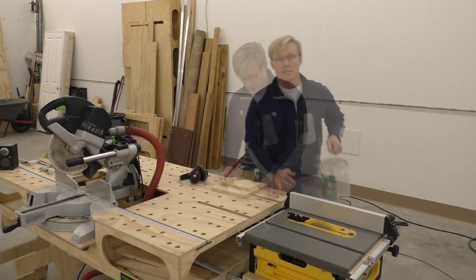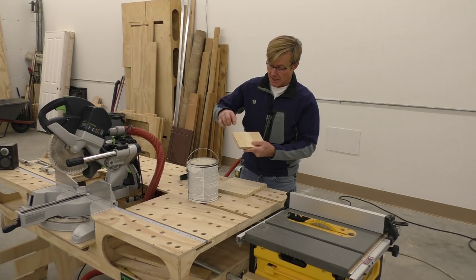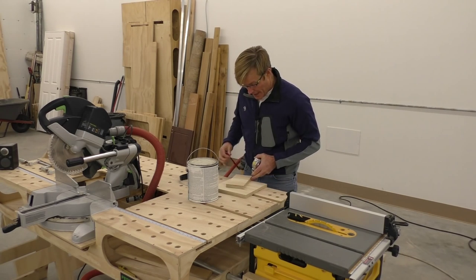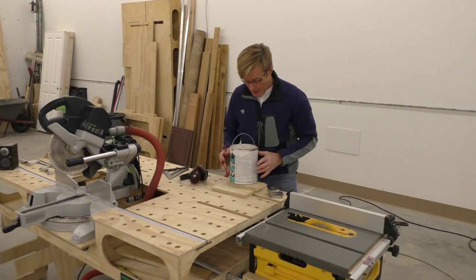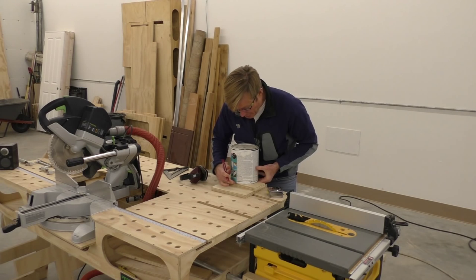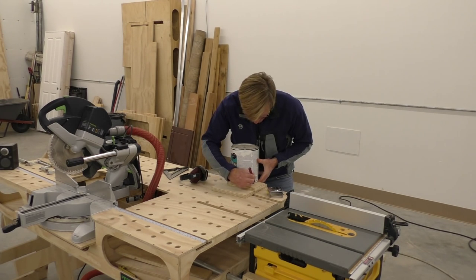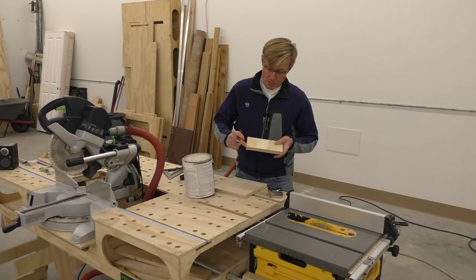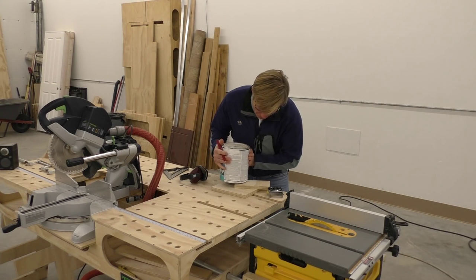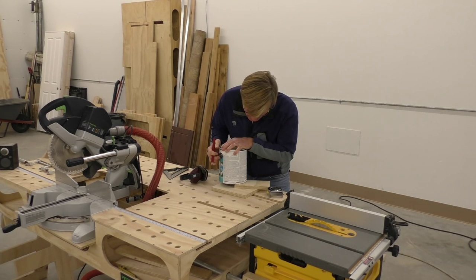To make the cutter with a curved shape in two directions for the handle, I could use a compass, but there's a quicker easier way. The main part of the curve where my hand goes is going to be six inches of this eight inches from the back edge. I'll square a line down at six inches, then take a one-gallon paint can and trace to the top edge. Then I want to reverse the curve so it comes back out about a quarter of an inch up from the very bottom corner — I put the can where I want it to end and work it around until I've got a smooth shape.